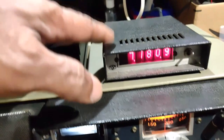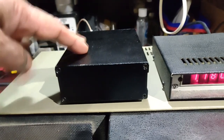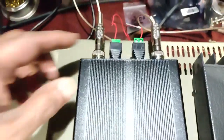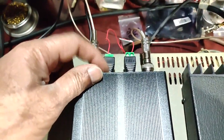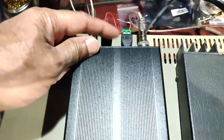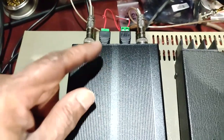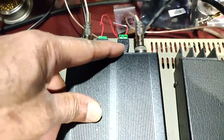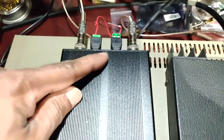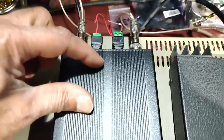I was using an external frequency display, so I thought why not add another extra module here as the amplifier — instead of trying to accommodate it within the chassis. I have separated the VCC for the main amp and the bias and driver voltage, because the Atlas 210X doesn't switch the final power supply — it is always-on, supplied from the T-line on the 210X, which supplies the driver as well as the bias.